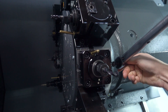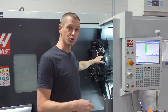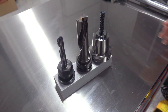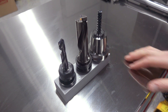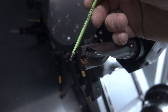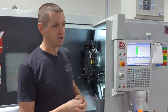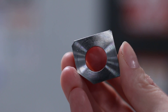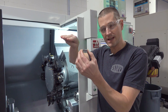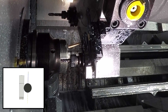Capto isn't the cheapest stuff on the block, so for now we've been using it for the driven tool holders, although we did pick up one static holder. This can be used to hold either a drill if you're drilling on the center axis — where the drill is steady and the part's moving — or it could be used for a boring bar. The Sandvik 880 drill is really cool; it's a 0.937-inch drill. You stick it into material, it drills a 0.937 hole — but that same tool can also be used as a boring bar to precisely open up an ID to, say, one inch. The first batch of parts we're making use an end mill, like a milling machine, to mill the outside. This part actually has a taper along the face, where the helical seven-flute comes in to strafe the surface — a simultaneous YZ motion as it's coming across that part.